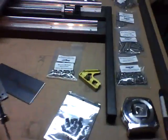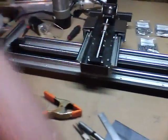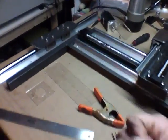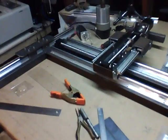What a winding stick is — let's say you have a big countertop glued of many different pieces, and you've got an old school hand plane, and you want to flatten that countertop. You've got two things: number one, you want that countertop flat across, and you could take a straight edge and go boom boom boom and check it all the way across. But you also want to know if that countertop has any twists in it.